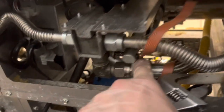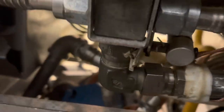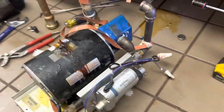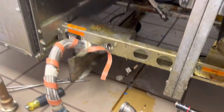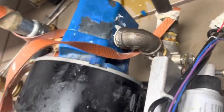As you start to drop the motor, it's just going to be held up by its hoses, so you take off this lower manifold hose at a flare connection, and then there's another one at the pump that's easier to get to if you drop the front. So after much ado, here's our buddy. There's a heat tape that lives on the system so the oil doesn't harden in there. There are two bolts — one here, one on the other side — and that's going to let the motor and impeller separate, but we've got to loosen the motor bolts there first.